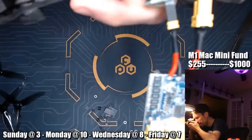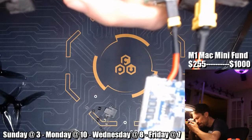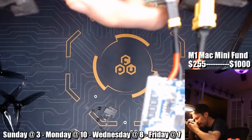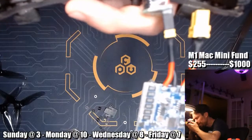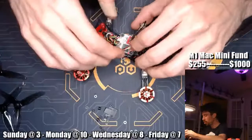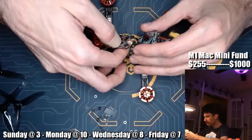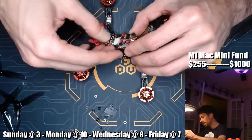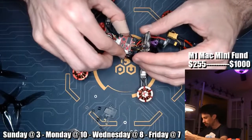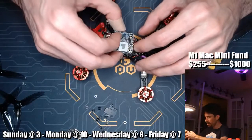And the flight controller is fine because it runs off of the USB. So I mean, I guess the 5-volt BEC may have shit the bed, and it's just shorted wide open, which would make plugging a battery directly in pretty hairy, right? Because it would kind of explode. It would possibly grenade the ESC, I think, right?